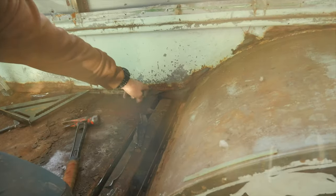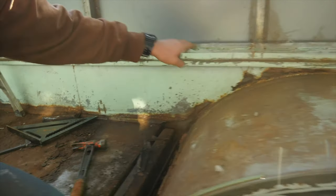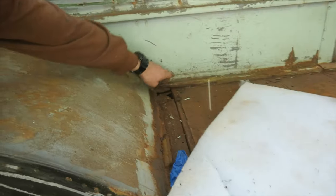I'm going to jump up to the wheel arch now and get cracking on that. I've been chatting to somebody about the wheel wells and I'm going to be cutting quite a bit out. Basically I'm planning to cut up here and remove that whole section of wall, which allows me to get in there and repair the wheel well. I don't particularly want to be cutting more out than I need to, but in the long run it's probably best to have a nice solid foundation to build off.